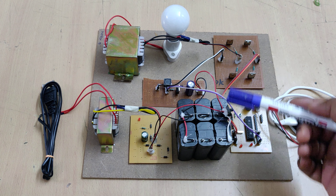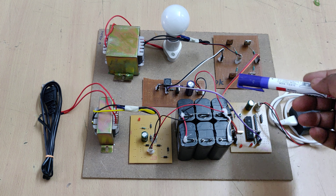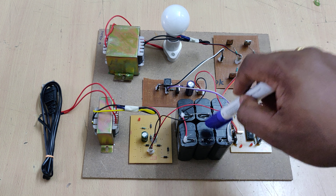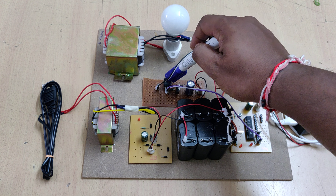When harmonics are generated, the current from the charging circuit gets low, and the battery charging time increases. In order to maintain maximum voltage with maximum current sufficient to charge the battery, that is achieved with the help of this buck-boost converter circuit with single inductor based driving.